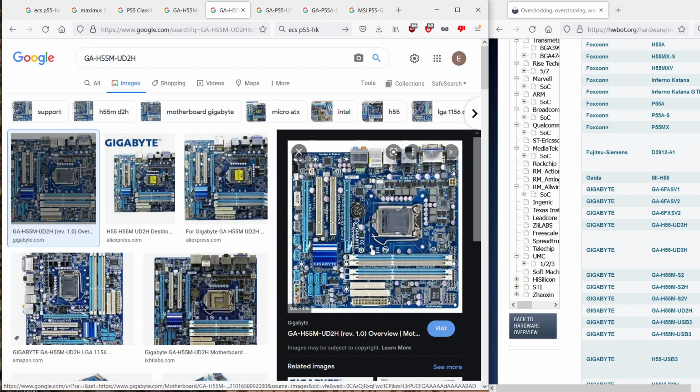In my opinion, they have terrible BIOS reset behavior. My boards sometimes pretend to be dead, and you have to leave them with the power switched off for a while until they recover. Random stuff like that. But I think a lot of that might be to blame on the Gigabyte dual BIOS, which is, in my opinion, absolutely terrible. So I actually want to try fixing the terrible behavior by desoldering one BIOS chip someday. Anyways, that is the absolute starter board for 1156.